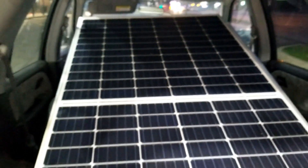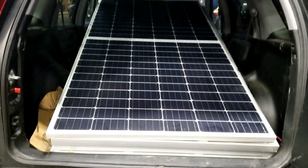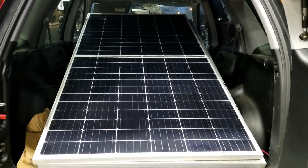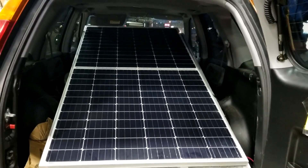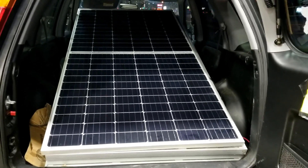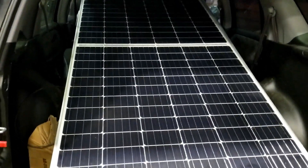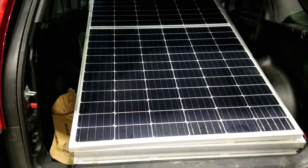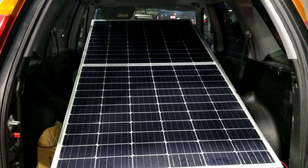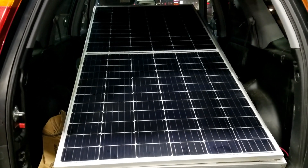Just picked them up. There's a cell behind and a cell at the front. It's going to be something interesting — it's nice to have them on a tracker. You can also mount them really high so they can pick up light from underneath and from the top. The only thing is, if you install them on a roof it kind of destroys their output because they don't make full power — they need to reflect from both back and front, so the roof just shades the back. They're best on a ground mount, and if you have a tracker on them it's perfect.